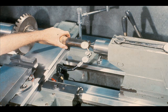Another very important step in examining the parts is to install both the high- and low-speed shafts between centers in a lathe and check the shaft centers for run-out. This may be done by positioning a dial indicator at the end of the shaft, as shown here. A reading other than zero run-out at this point would indicate the need to draw the shaft center to the true center by re-machining.